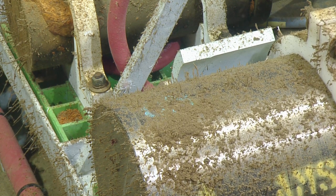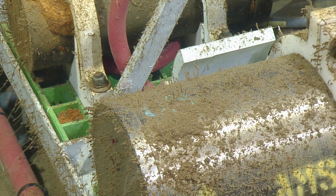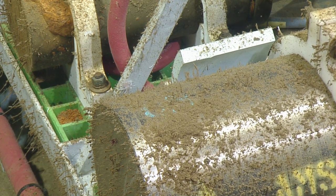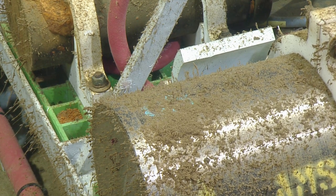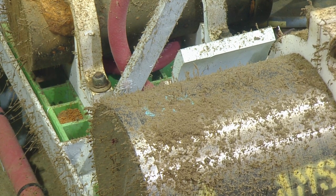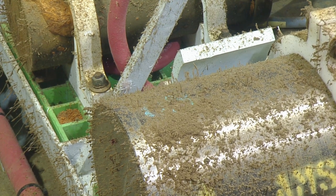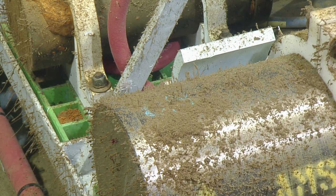It looks like O-N to me. It does look like O-N. Looks like O-N to me. But it's definitely ON. So maybe this one went down with the dummy in the battery connector, and they mated it subsea, perhaps. And you can mate it subsea when it's on? Oh, you would... Yeah, I guess so. It'll displace the oil in the connector. We never do that, but it's just strange. But even the one in the picture is wrong, then. I'm guessing. You wouldn't do that because the pins are on the battery side.